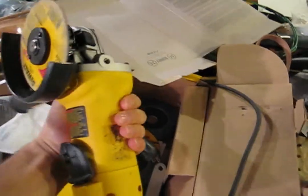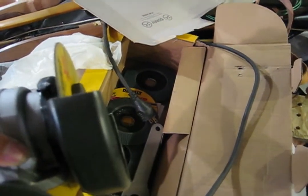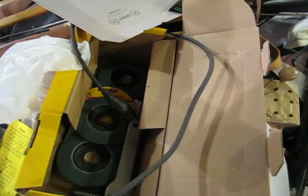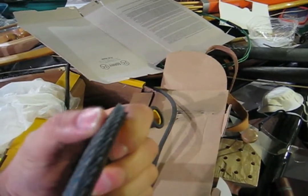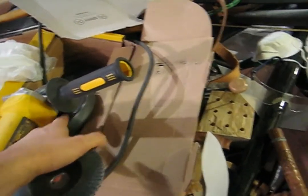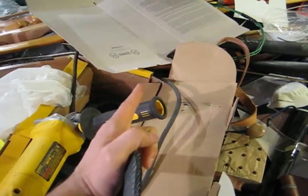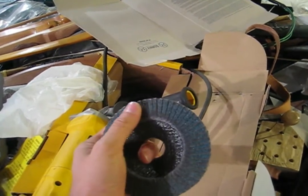There's a cordless drill. Over here we have an angle grinder — it's a nice DeWalt angle grinder. This is really great; it has a cutting wheel on it. The cutting wheel is great for cutting through steel — it does exactly what it sounds like. It also has these sanding discs, which are basically little pieces of sandpaper at an angle, so it rolls against the material. You use the cutting wheel mostly to cut straight lines through basically anything, and you can use the sanding discs to round off corners, make things flatter, and reduce the thickness of things. We'll demonstrate how that's used later.